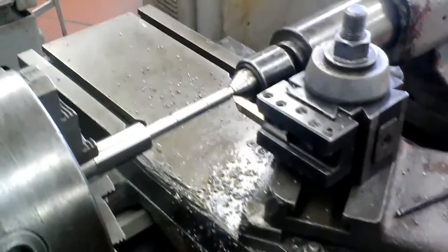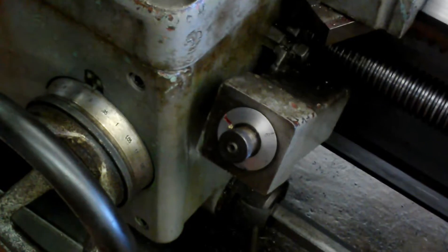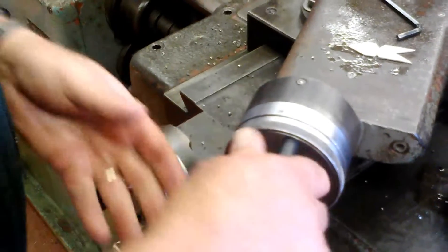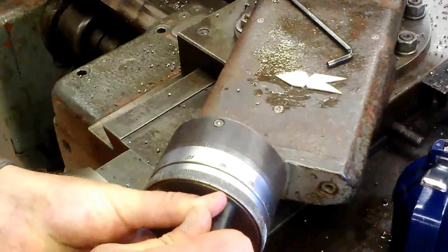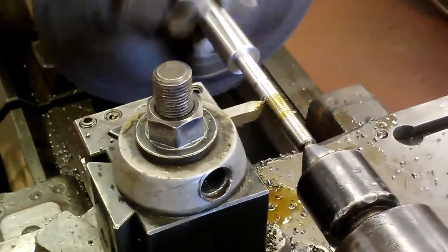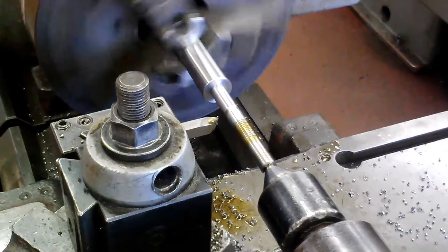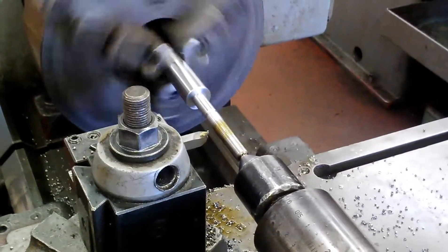Now to move this out, back to the beginning. Over on this side is where we're going to have to pick a number. I'm going to lock this in and keep that same number each time. This one only has one number, and I'm going to grab that number six. We're going to engage it with this lever and we're now machining. Now that I'm moving, I'm going to go in and touch off with a little oil on it. I'm going to back out real quick, throw it in reverse. Now I'm already set — I don't have to worry about picking that same number up each time. It's a little faster method.